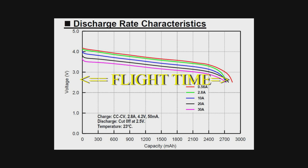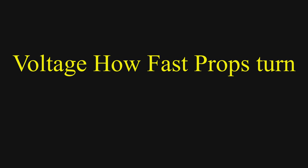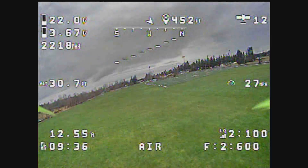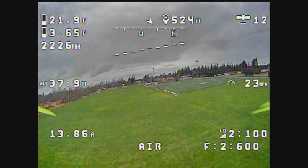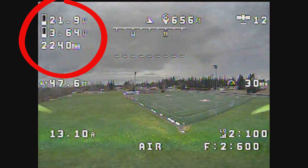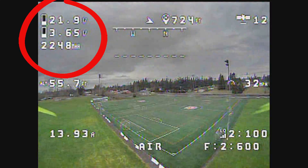The other indicator is the amps used — this is effectively how long the S-curve is from left to right. With a low amp pack, say 1,000 milliamps, this line is very short; maybe you can only fly five minutes. With a larger capacity pack, this line will be longer and maybe you can fly eight to ten minutes. Voltage is what keeps your props turning; amperage determines how long they'll turn. Whenever I build a new quad, I set it up with motors, props, and battery pack, then do test flights documenting both voltage and amperage.